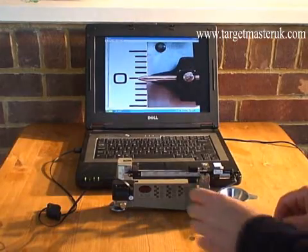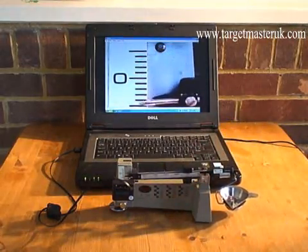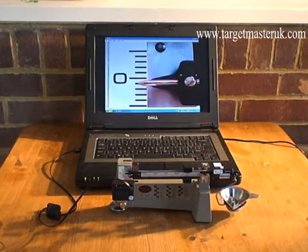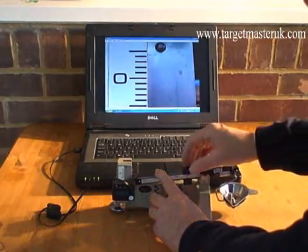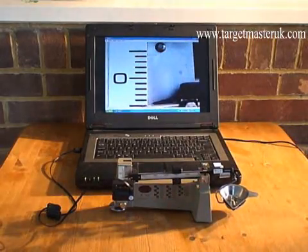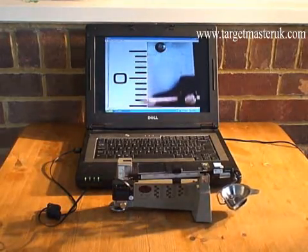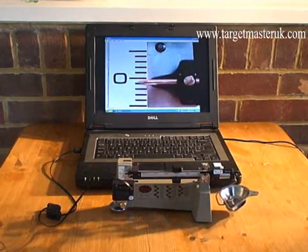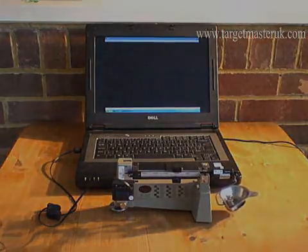And that's pretty linear right up through the range. I'll put a fifty grain in there, which will bring it up to a hundred. That's a hundred, that's a hundred point five, and four kernels. I'll put another hundred in — we've got two hundred. So at another five kernels of powder, two hundred grains. Replace the pan, put them back on. And a good repeatable set of scales.